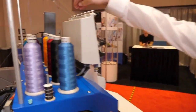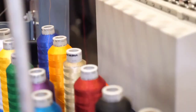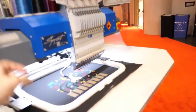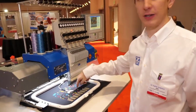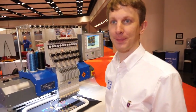And we can take one of these, and I think it's right in the middle there, you'll see that's the conductive thread. So the one that's maybe this one? Correct, yes. That one is a conductive thread? Yes. But it just acts like a thread? It acts like a normal thread, and that allows us to use the traditional processes for embroidery to do stitching and to create different sensors and connections. But the PCB, you have to put it manually later? The PCB is the only manual part, so we create a little textile jig that allows us to lock our PCB down, and from there on out, it does the rest of the stitching automatically. Do you have any smaller PCB designs?